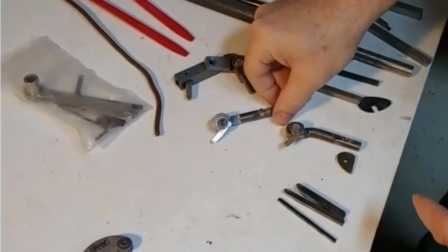Now the John Jordan tools that he sells, he also uses set screws to hold the cutter in there. And I like the set screw method. Every now and then it loosens up due to vibration, but you can take it out of the holder and sharpen it a little bit more conveniently. The Trent Bosch version has his glued into the shaft with super glue, CA glue, and he sharpens the bit freehand without taking it out of the shaft. It's an acquired task. I guess I don't prefer to do that. You can break the CA glue bond relatively easily with a torch. Give it 5 seconds of heating and it'll break, and then you can remove it to replace it or sharpen it. But basically those are your choices.